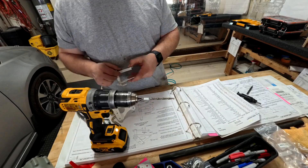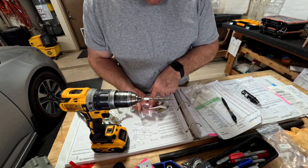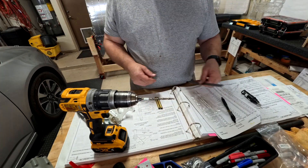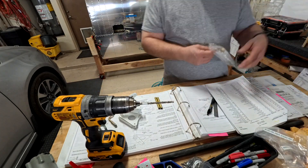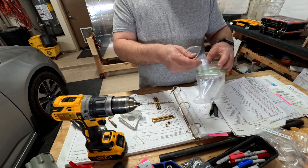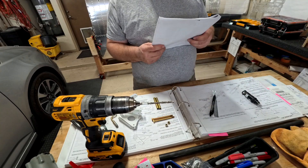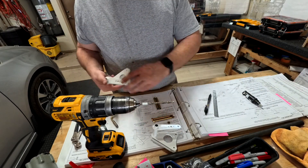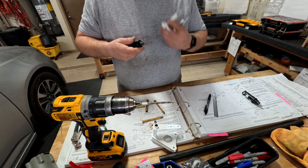You can see I drilled out the hole because those are powder coated. As I said in the last video, the powder coating gets inside and then the diameter isn't correct. I do basically the same thing with the brass bushings as I did with the threaded ends — I'll put them in the drill gun and use some sandpaper to clean them up so there are no burrs. I'll also use a drill to clear out the powder coat from the actuation piece so everything fits nice and smooth.